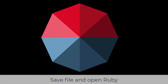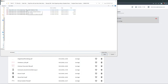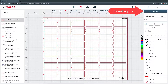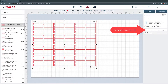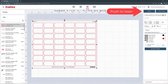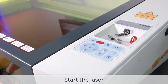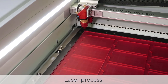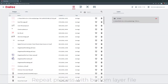Once the files are saved, open the Trotec Ruby software. In Ruby, select Import, then select the first file — I will start with the top layer. Select Open, then select the file and create a job. Move the file slightly away from the edge, then choose the material from the materials database — in this case I will use Troglas three millimeter cast acrylic — and then send the file to the laser for processing. Place the acrylic sheet into the laser, focus, close the lid, and start the file. The laser will engrave the black labeling and then cut the outline into the acrylic sheet. Once complete, remove the finished sheet and set the part aside.